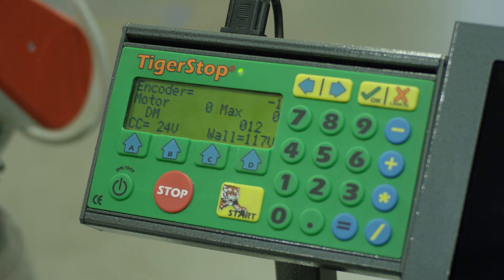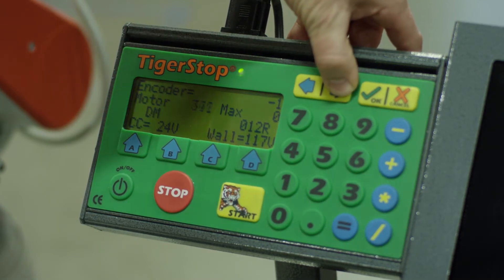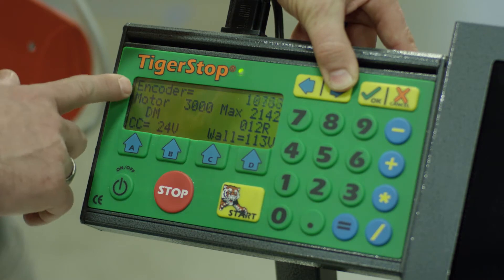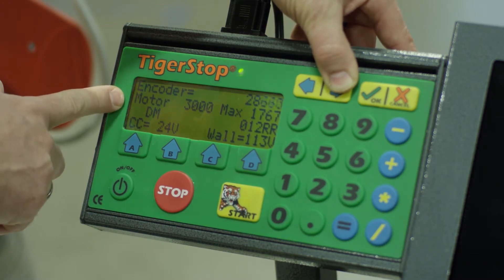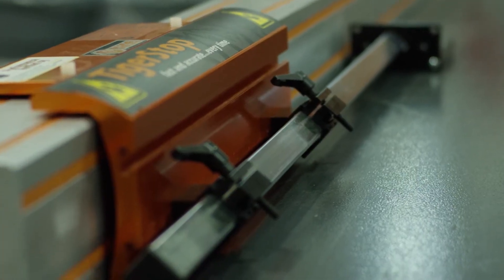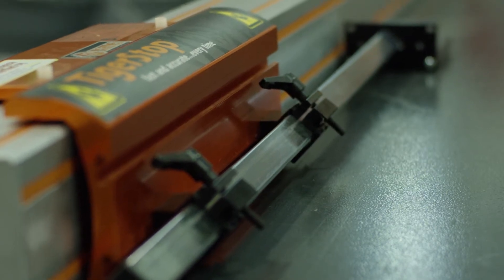The first thing we're going to do is use the blue arrows — the left and right blue arrows. If you press and hold them, we should get a motor reading. It's important to note that our motor goes positive and that our encoder reading is positive as well. So when we press and hold that, you'll see the encoder continues reading positive. What we're doing is looking and seeing that the carriage is moving out away from the tool — a positive encoder reading means we need to be moving out and away.